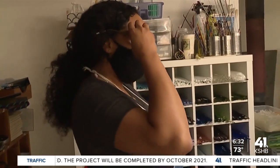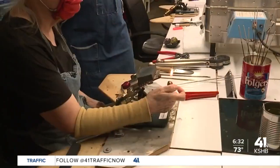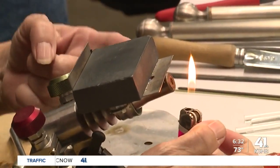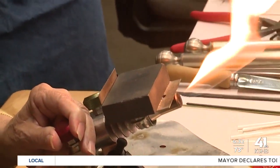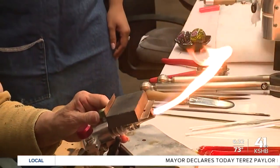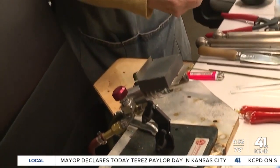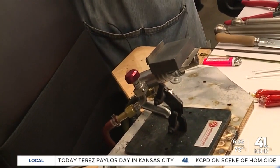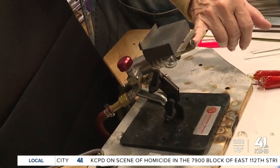First, I'm going to show you how to make a bead. You light the lighter first and put it right next to those jets. You're going to open it to the left — there's the propane — and then you add the oxygen. The hottest point of the flame is right here, what we call Brazil. Kansas is in the middle because it's a little more neutral, and Canada is the coolest place.